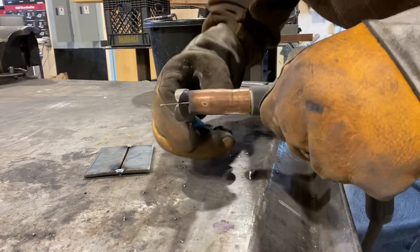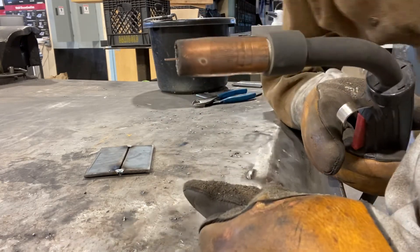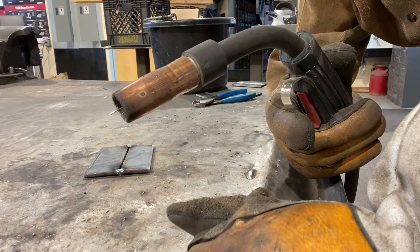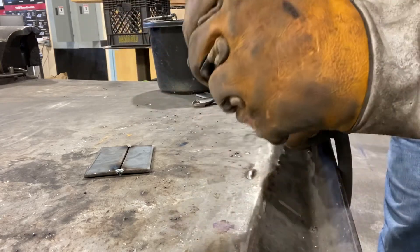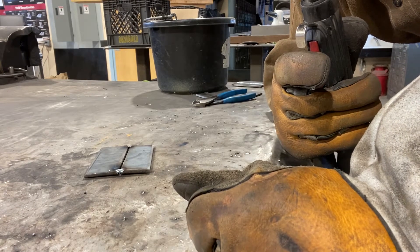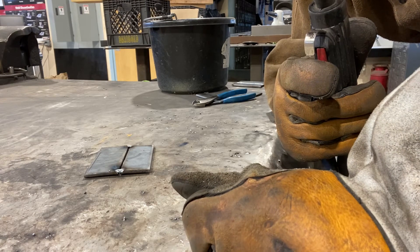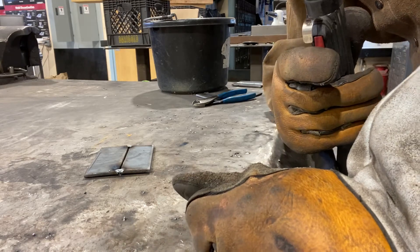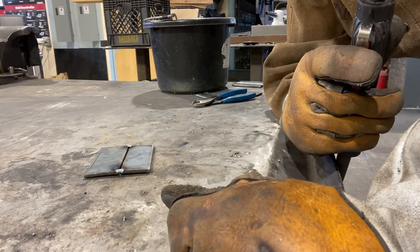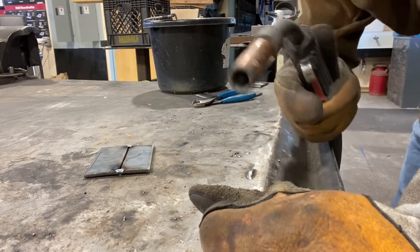It takes a little bit for the arc to build up and get a consistent bead. So what I do before I ever start my weld is cut off that wire so I have a nice clean piece to start with. Every time you go to begin your weld, if you leave that molten ball with a discolored wire, it creates a splash of spatter and sparks that can burn through your leathers or burn the back of your neck. Also, that inconsistent arc starts like dot-dot-dot and then splashes into a clean arc. To avoid that, just cut away that little piece of wire and get a nice clean piece before welding.